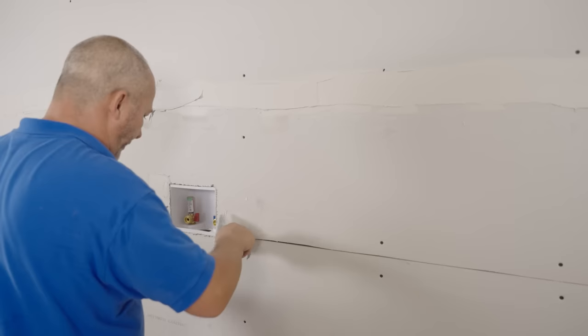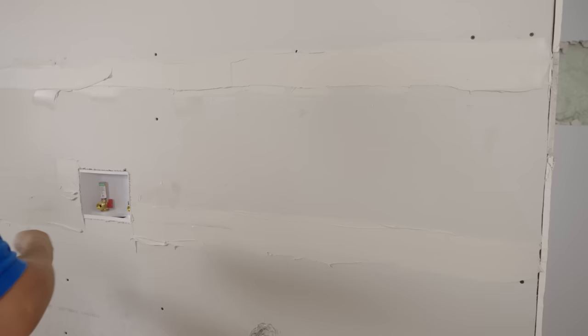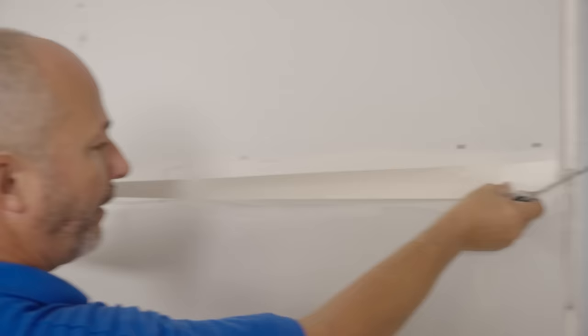These laundry boxes have always got that little mounting bracket hardware that creates a protrusion. So you're gonna have to be aware of that and ready to deal with it. Always means more mudding, okay? Okay, here we go. Now we're ready to go. I'm gonna set it.